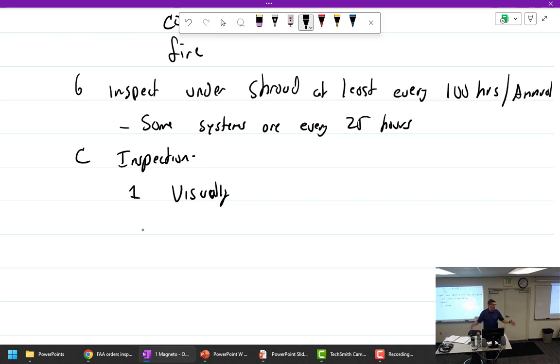Some shops have dedicated ones just for doing this. You don't vacuum the floor with it. First you start with a good visual inspection. Nice light, flashlight, look at every bolt, every joint, every weld joint. That's where it's going to get a failure. Visually, and then with compressed air.